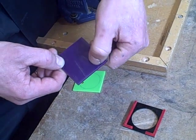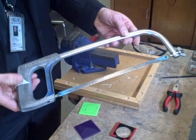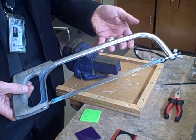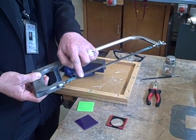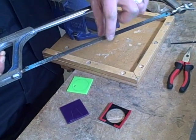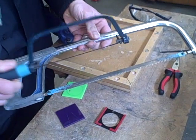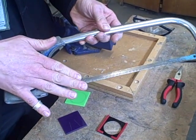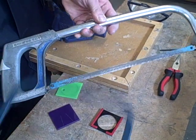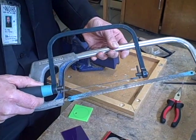Because we are trying to cut a straight line, we will be selecting this, which is a hacksaw. Now ordinarily the hacksaw is used for cutting metal, but it cuts plastic sheet very effectively as well, because the teeth on it are so nice and small. You'll notice that the blade width is considerably wider than the coping saw blade, which makes this a better choice for cutting a straight line. The coping saw was the perfect choice when we were trying to cut lines that were curved or not straight.